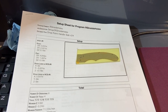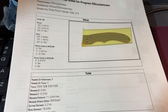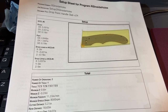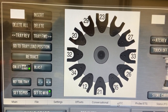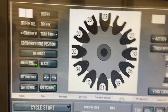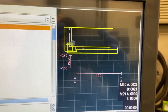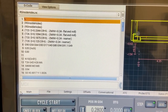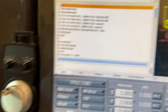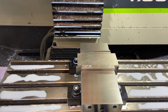For this handle slab we're doing the inside holes first — only four tools: 23, 26, 33, and 35, just drilling and reaming. We've probed the XYZ point on that corner, the program is loaded, and it should be a fairly quick cycle. This will be our first piece of titanium we're cutting on the Tormach.